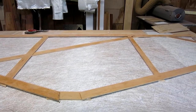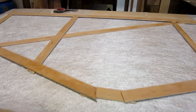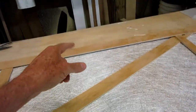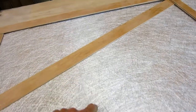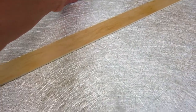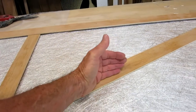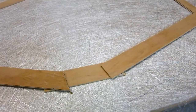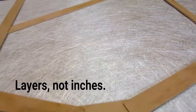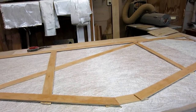So my first goal is 1 chop, 2 woven, and the wovens are going to come further and further down the transom so that when I finish the top of the transom I can overlap all these different areas. This is the biggest piece. The chop will be maybe 3 inches less, and the woven will be 3 inches less, and then 3 inches less, and then 3 inches less. My goal is to have about 6 inches where the stringers tie in, and then I'll feel safe tying in the stringers, and then we'll do the rest after the stringers are tied in. I can finish my floor finally.